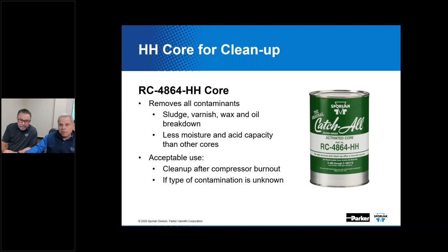Okay. And now the same individual mentions this when you were talking about solid contaminants. It says, by solid contaminants, do you mean the metal thrown off by a scroll compressor, or what are you talking about where it comes from? I'm not so much concerned about its source necessarily, but if the question is what is a contaminant, I'd say anything that's in the system that's not refrigerant or lubricant.